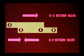The C2 retard valve is responsible for retarding C2 clutch release in shifting up from low to second and in shifting down from high to second. The C3 retard valve has the same purpose in the shift down from second to low. An example of the retard valve purpose in the system can be given in the low to second shift cycle.